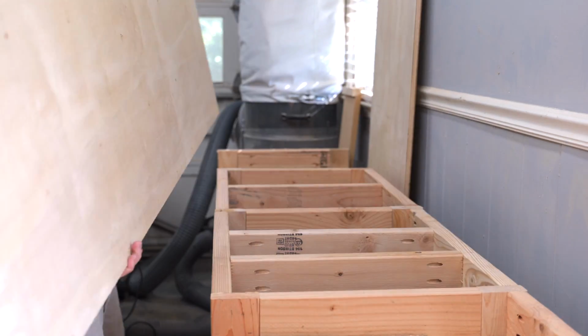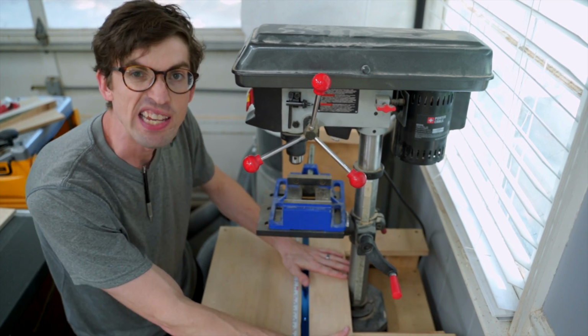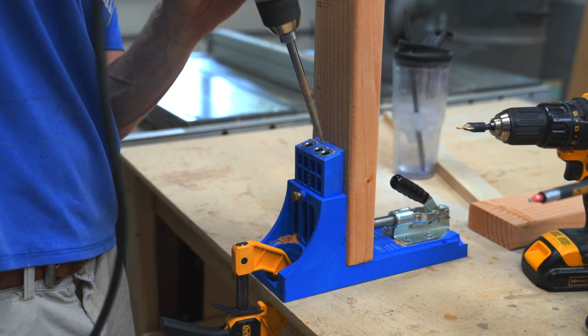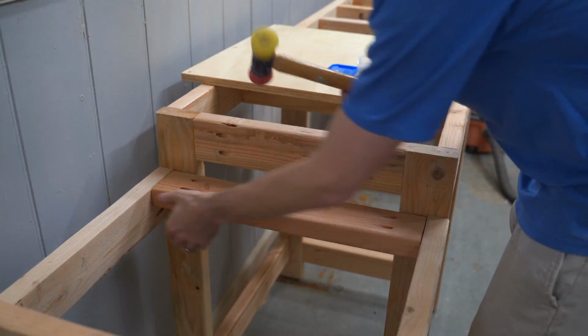So now we're gonna work on the drill press section of this build. The big thing I wanted to do is actually get this base off of this. But if I had wood going across this, I didn't want it to hit the base. So I'm just getting the base underneath, and all I'm really doing is just cutting out a section on the 3/4 inch plywood, and then I have another base that this thing can sit down on.